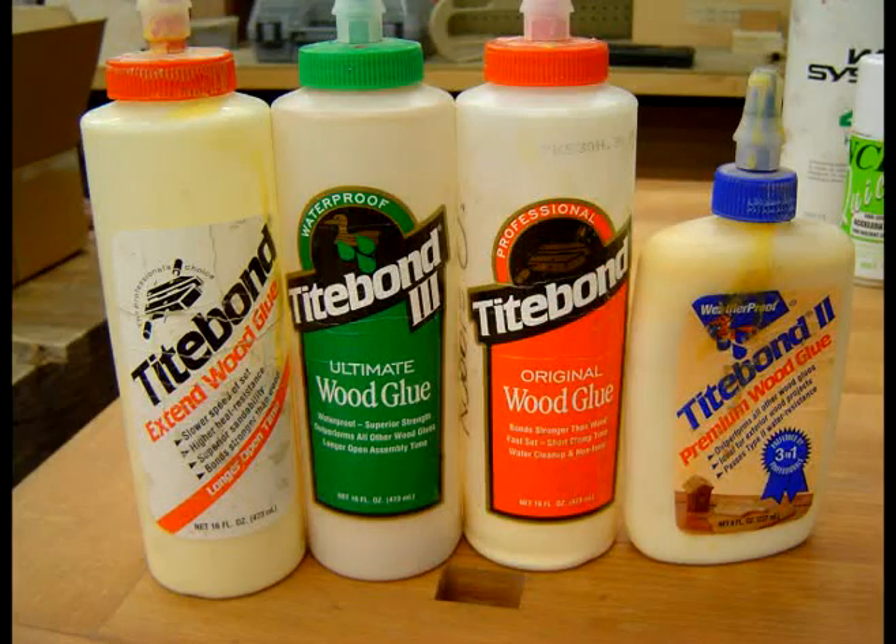The same company makes Titebond II and Titebond III. These two versions of the glue have a slightly higher melt temperature and also a higher moisture resistance. This can be useful when laminating and bending bindings and purflings. However, one of the drawbacks is that you never want to join a lightly colored top or back with Titebond II as it can discolor the wood.